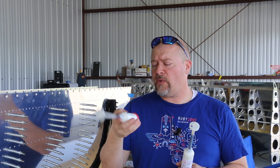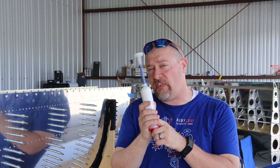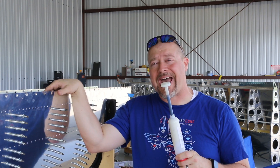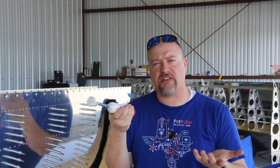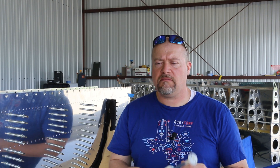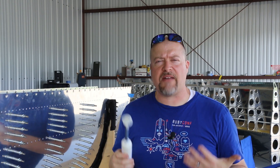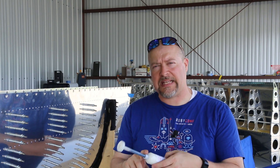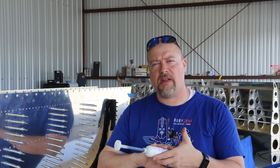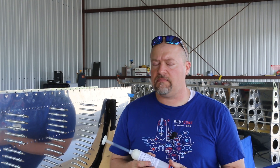I'd say get four or five of the small tubes for the ribs and maybe two of the larger ones for the back — that way you'll have an extra one if you need it. If you screw something up, throw that one away and come back the next day; you still have one and you don't feel like you have to rush, because once the catalyst hits the primary goop you're on a clock, and that clock is pretty short.